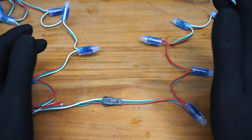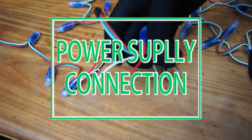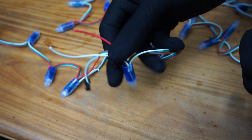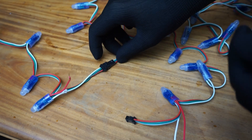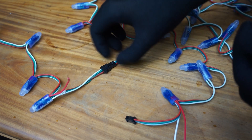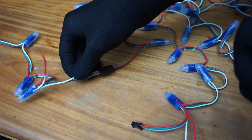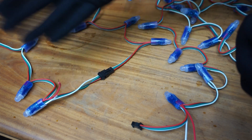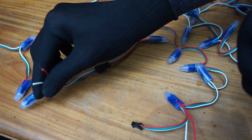Now it will work as a single pixel LED string with 100 pixel LEDs. If you look at the first pixel LED of this string, you can see two wires coming out of it — these are the power input wires. The connection between these two pixel LED strings does not provide enough power through those wires because, if you look at the gauge, they are not capable of carrying enough current throughout the layout. That's why we need to input the power through these power input wires.